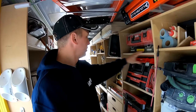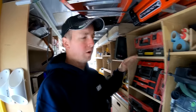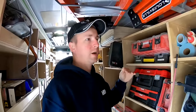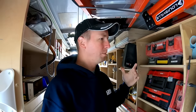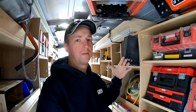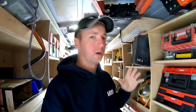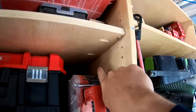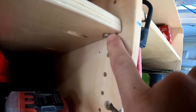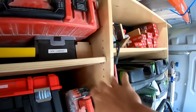These horizontal members aren't just sitting on shelf peg holes. On the underside of all these shelves I use pocket hole screw joinery, and I've done that on a tool trailer and another work van — pocket hole joinery has worked great. So if you've got a Kreg jig, it will basically pay for itself on your first vehicle outfit because you're going to drill a lot of pocket holes. You can see underneath here a peg and the pocket holes — I set the shelf on the peg to get it in position, then screw everything together with those pocket hole screws.